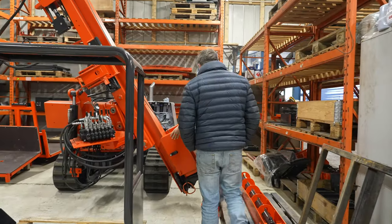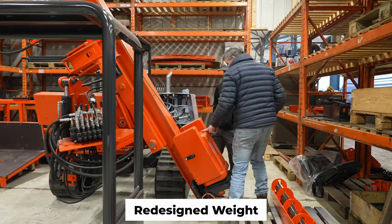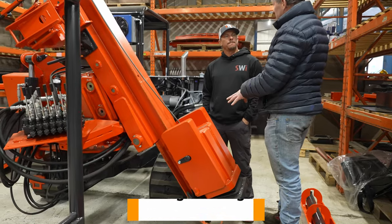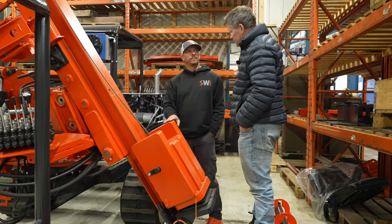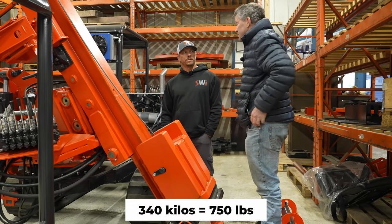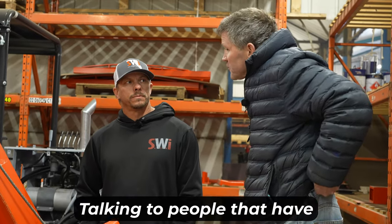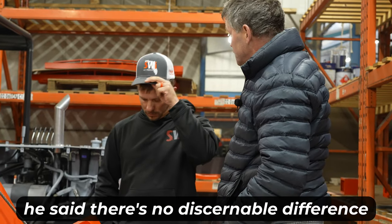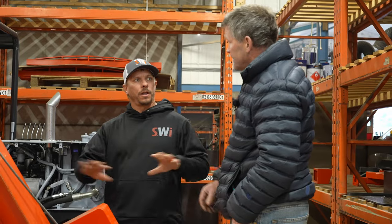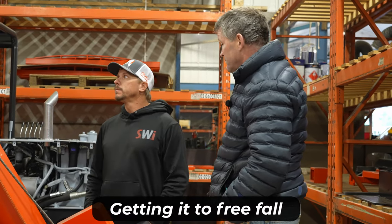This weight looks a lot different than what we saw before — are you redesigning it? It came about because we couldn't get the billets, so we redesigned them this way. The most popular weight is 340 kilos. You can go bigger, but talking to people that have been running 400s — Peter was running a 400 before and said he noticed no discernible difference because we're dumping faster. It's all about getting rid of the hydraulic fluid quickly so that ram comes down very fast — it's about getting the free fall.